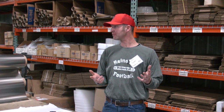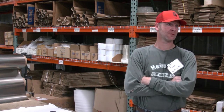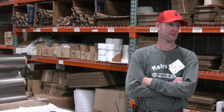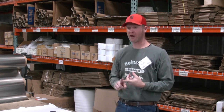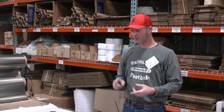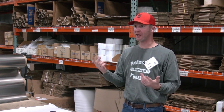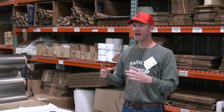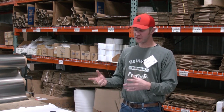Are there any questions? Anybody got any questions as of right now on anything in this process? Of everything we've talked about, what do you think is the most important place to start for most of us who haven't made them? We have never made a folder. The easiest way to start out is to get a pattern. Find a knife you like, a frame lock or a liner lock. Take it apart and copy it. Copy the knife.